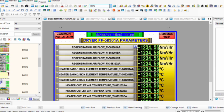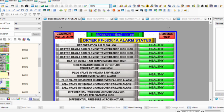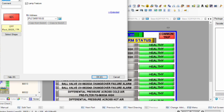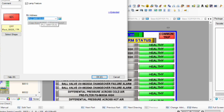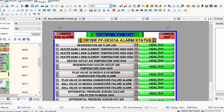I must also tell you how to use a register address through a bit, because I was also confused about this. This is my digital address — the 4-series is the data register, 0 is for output coil, 1 is for input coil, and 3 is also a data register. If you are using the 4-number series for digital input, you write the address like: 4 1 3 0 point 0 2. That is the setting and wiring for Modbus — I hope you understood.